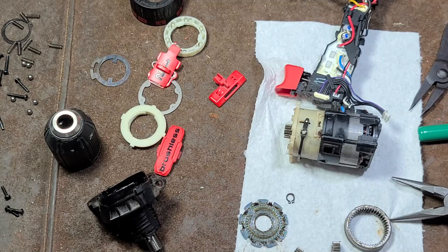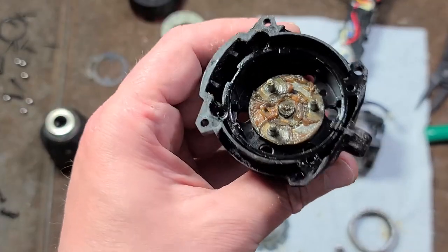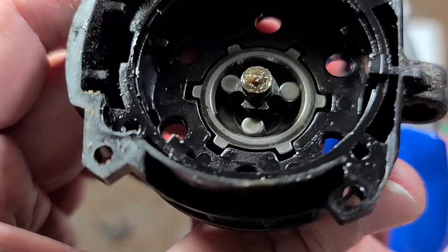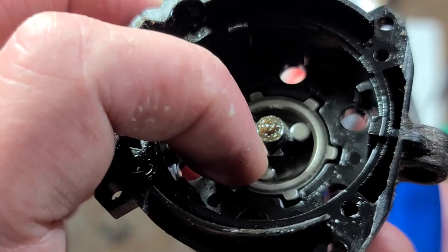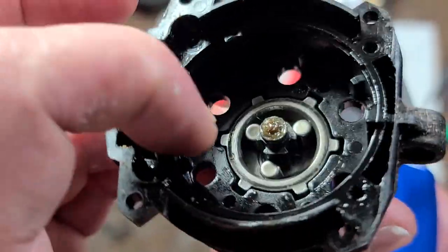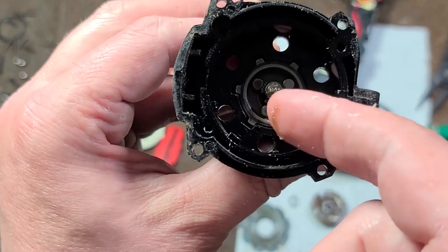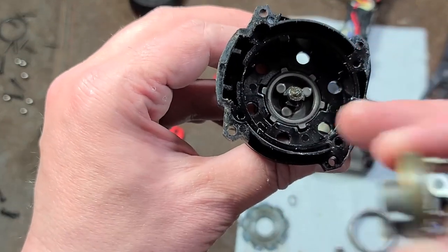Continuing beyond that little detour. This is a big expense — look at this part because you have to have it totally machined. Two ground surfaces here for the spindle bearing, and you have to have grinding done to actually cut that shape. There's a bunch of different machining: a little undercut, threads, drill hole, more threads. This surface right here has probably got to be ground so that the chuck will sit straight. Quite a bit of little machining — it's going to be an alloy steel, hardened.